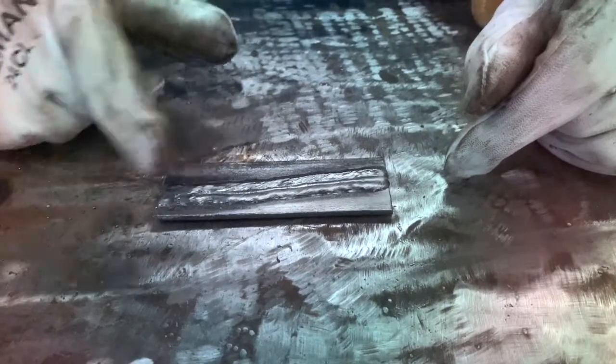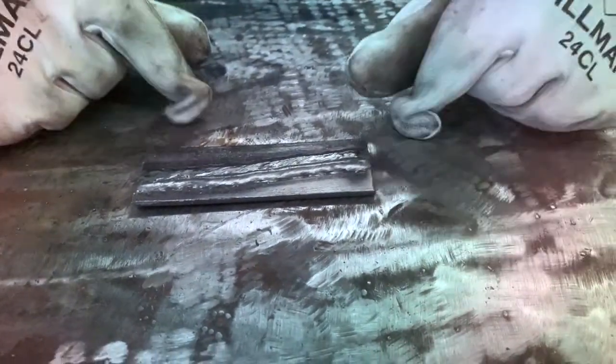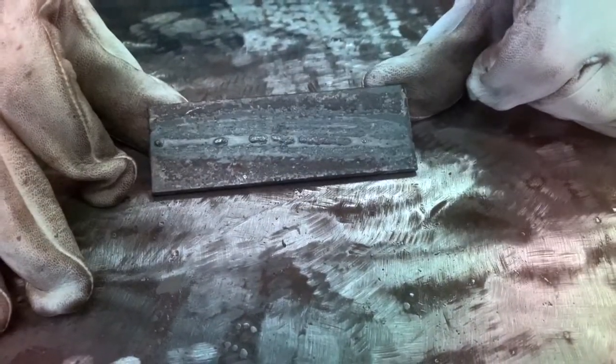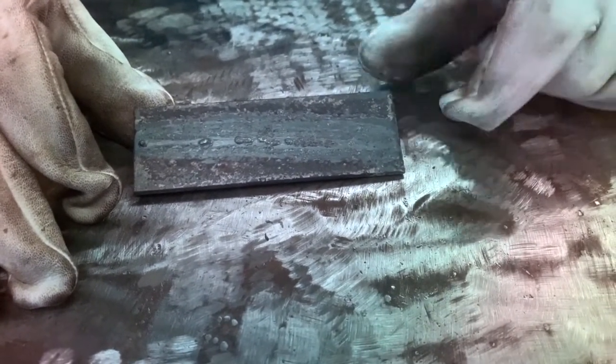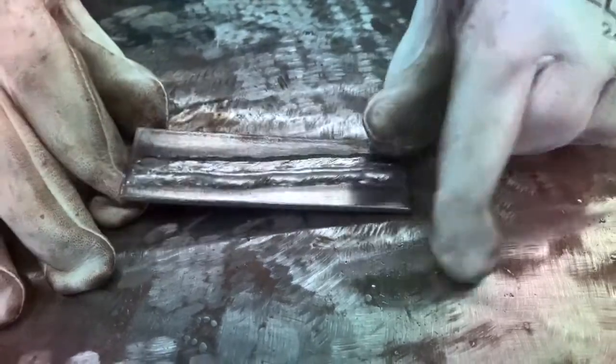Here are our two beads. It wasn't quite straight towards the end, but this looks very nice. One of the things to look for on the back is you can see the heat marks, and on the second bead we're getting a little bit of melt-through, but the first bead the heat's perfect. That's what we're looking for when you do your bead control.